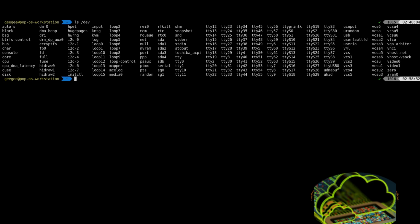Now, we're also going to use a piece of software. I like to use Minicom, but we can use Picocom, we can use Screen, we can use a bunch of different options. Use whatever you prefer, but I like Minicom. We're going to do minicom -s. It's going to bring us to our setup. We're going to set up our serial port here. I'm going to go to /dev/ttyUSB0.